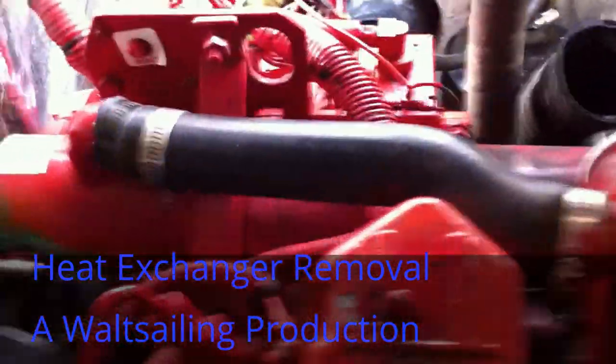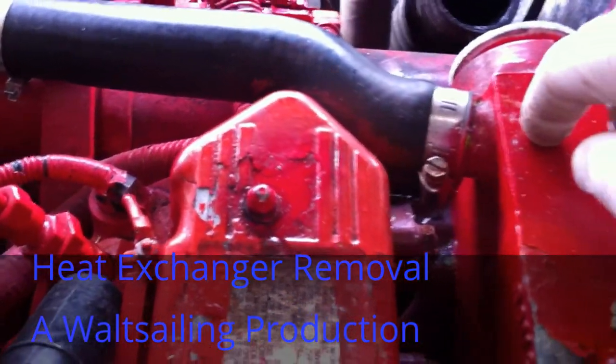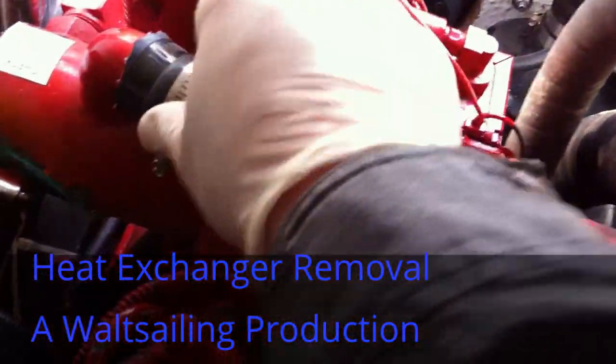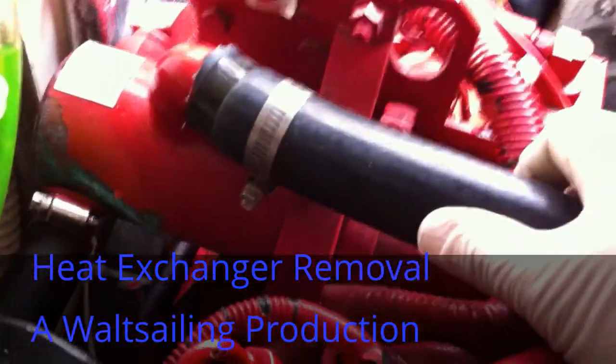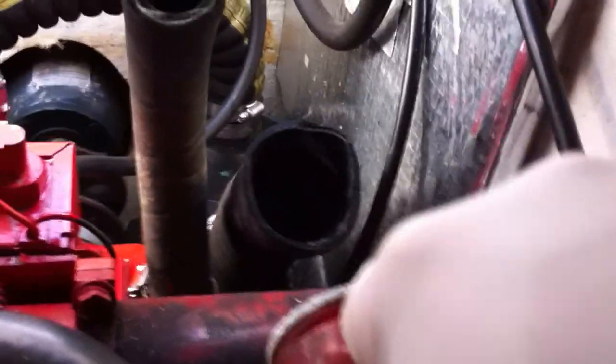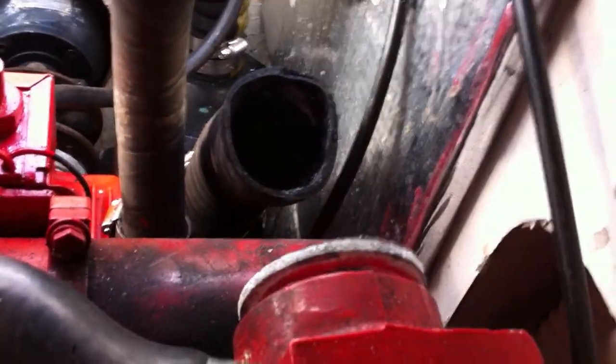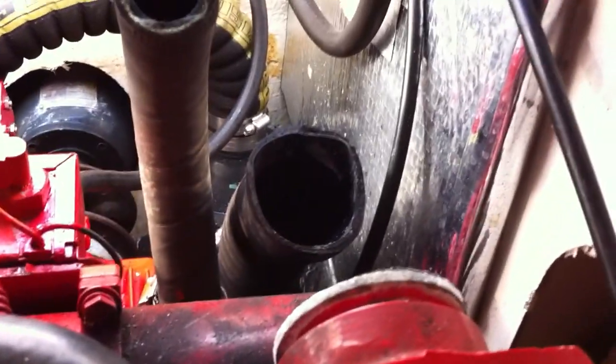I'm going to take off this hose which goes between the top of the engine here, the exhaust right there and over here on the top of the heat exchanger - we're going to need a new one of those. I've opened up the elbow on the back of the boat and it's time for a new elbow. To get this thing off, use a little bit of a heat gun and heat the hoses up a little bit, and out it goes. One elbow removed.